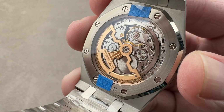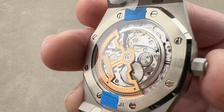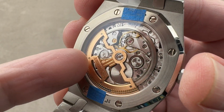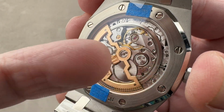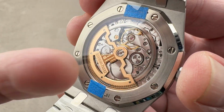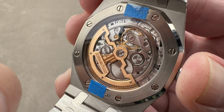And it is ultra thin. The base movement only 2.4 millimeters thick and only 3.05 millimeters thick with the date here. We have a beryllium ring that runs all the way around, and the rotor mass sits on that. There are 4 ruby roller jewels that allow the mass and the ring to be super close hauled to the base plate and the bridges, but with no danger of contacting them under conditions of shock.